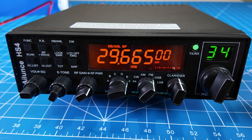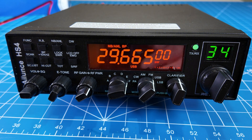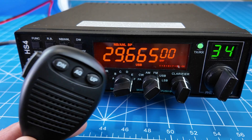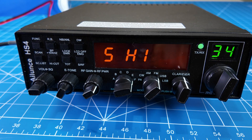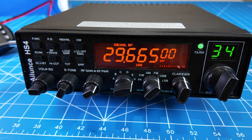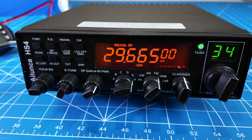For example, now that I have the mic plugged in, I do not have an antenna connected. If I try to transmit, it will not let me — the SWR is too high. It doesn't want to burn out the radio. It also has a high or low voltage feature to help protect your radio, which I find cool. So you are going to need a resonant antenna.